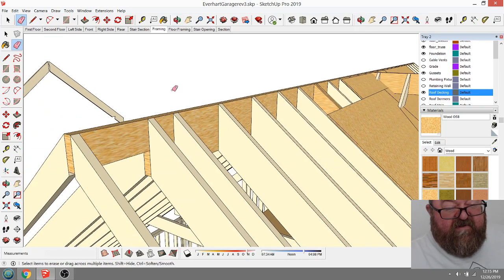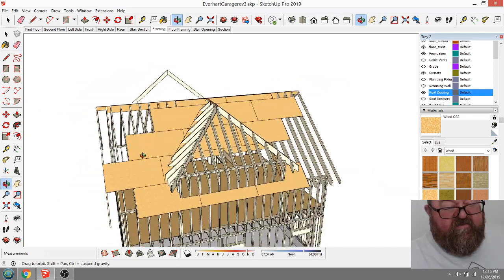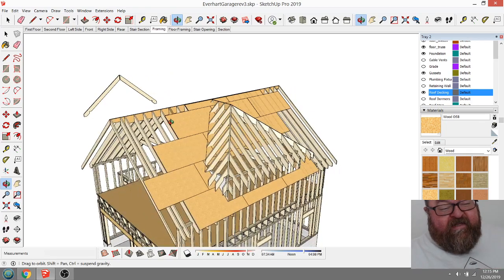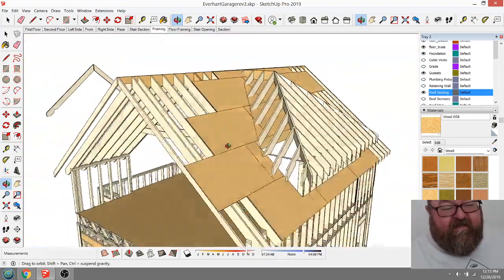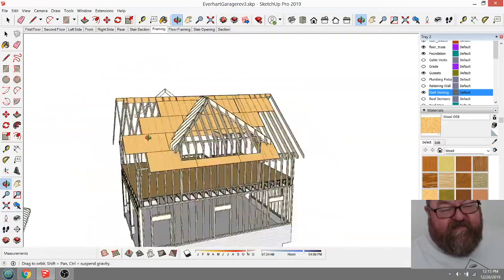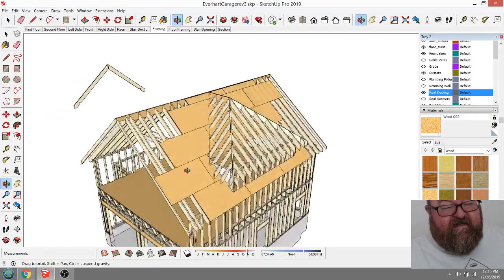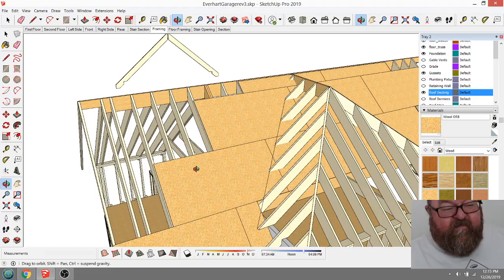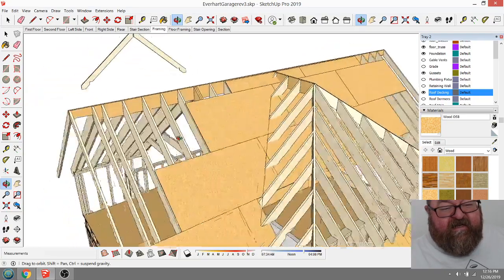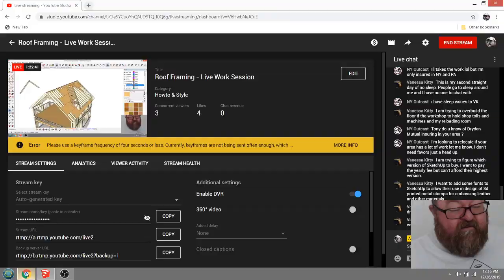But if I want to do the floor plan, and it's 1/4 inch per foot or 3/16 or whatever, I can't really do that. I can set up these different zoom levels, but that's not the same thing. Everything in SketchUp is drawn to full size. This literally is a 24 foot by 30 foot building. I'm drawing everything full size. Then I go to my paper space, and I scale it the way I want it scaled there. So I can take the same model and scale it however I want, depending on what I'm trying to show, whether it's a detail or a floor plan.